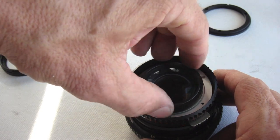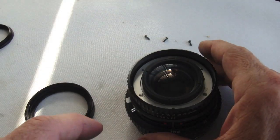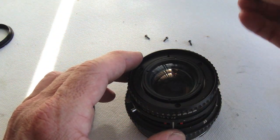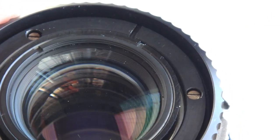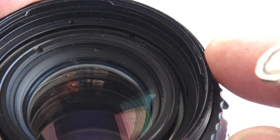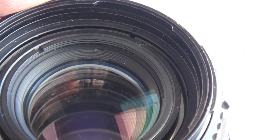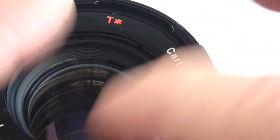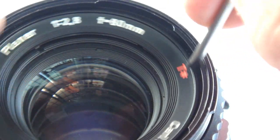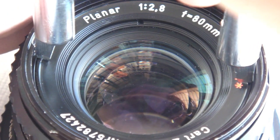The lens can be installed at this time or it can be installed later — it doesn't really matter. When you install it, the next step would be the final cover ring, which has a notch that is aligned with the bayonet ring. It'll drop into place when aligned properly. Then the final step is to install the nameplate ring. Once that's started, it can be spun into place with the tip of a screwdriver and then tightened down with a spanner — just snug enough to hold it.